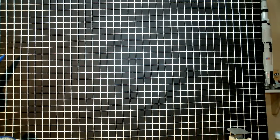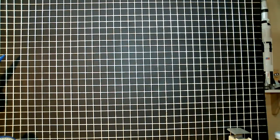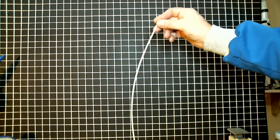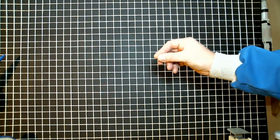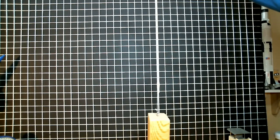What do we mean by tension and compression? Tension attempts to stretch the beam — in this case this balsa wood stick. Here I have my balsa wood stick attached to a weight, so that weight is pulling down along the axis of my stick, and so this balsa wood beam is in tension. Compression attempts to squish the beam. If I apply a force at the top, the compression will ultimately want to bend the stick — that's known as buckling. And actually, if I apply too much force, the beam will break and fail under compression. However, a beam can support quite a bit more weight if it's in tension, as opposed to compression.